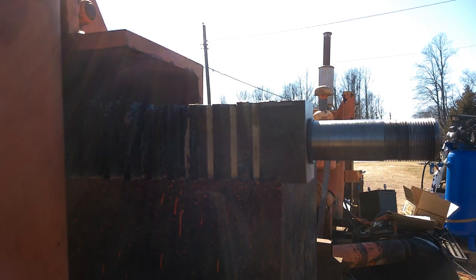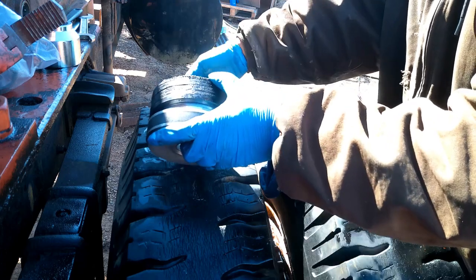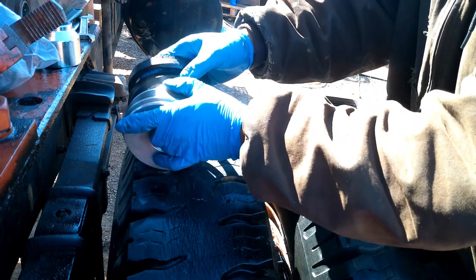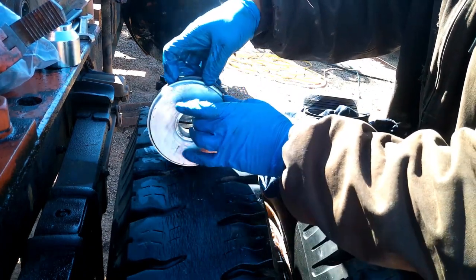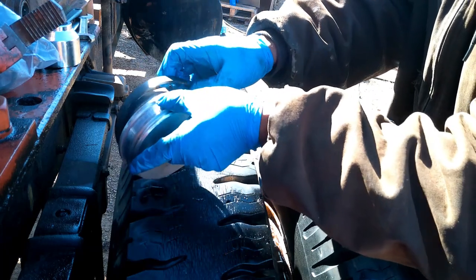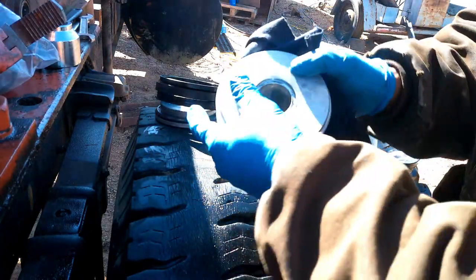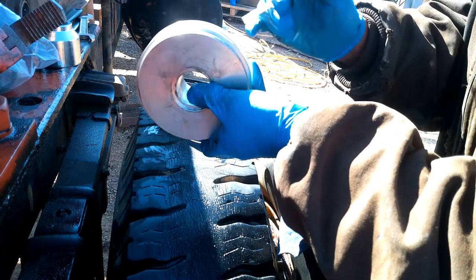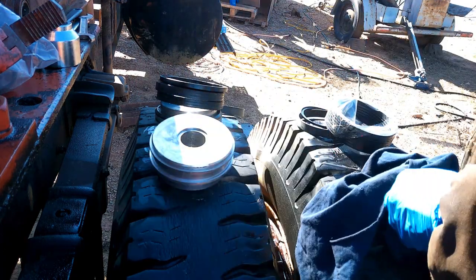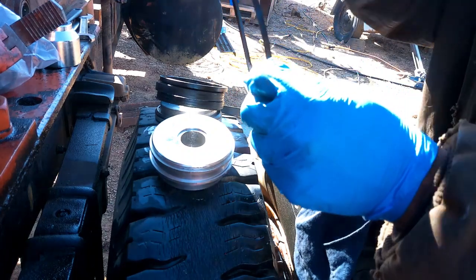Then next, put seals back on your pistons. See this seal, that's gone right there, that wiper seal. See, that's it. Whole packing right there. Then you got this piece. Clean it up a little bit. Use your pick if you need to. Clean it up. Put it back the same way it came. A wiper blade, usually on cylinders, that lip is going to be going to where it's pushing.